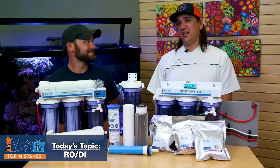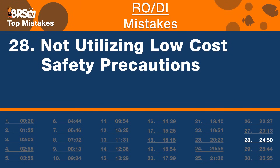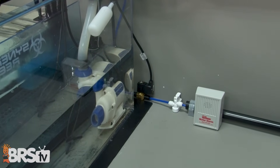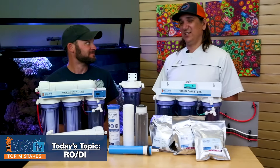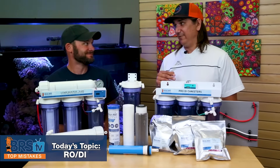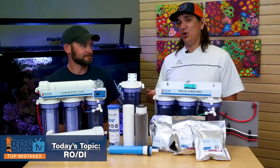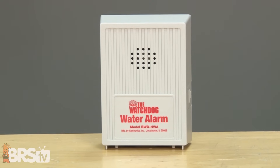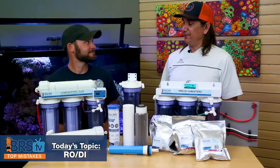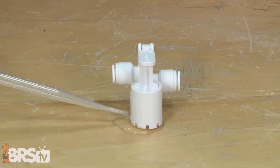Number 28 — with a never-ending water supply, these low-cost safety precautions are absolutely worth it. The mistake is not using tools like the Watchdog leak detector and the Flow Lock. The Watchdog is about $10-$12 and sounds a loud alarm if there's any leak. The Flow Lock shuts off water automatically. The most common leaks happen when you used scissors to cut tubing or didn't tighten a canister down quite enough. There's also a tray that sits underneath, collects water, and trips a float valve to automatically shut things off before damage occurs.